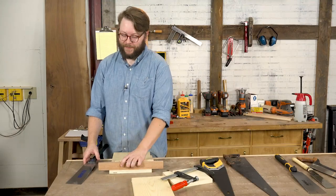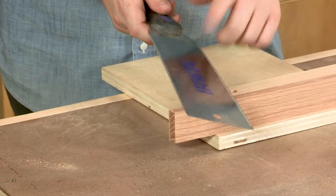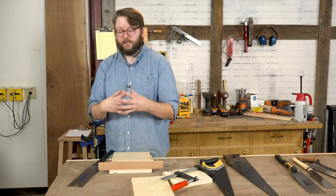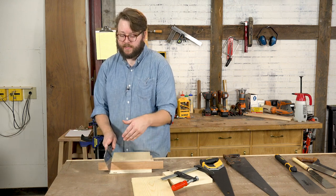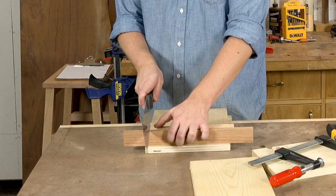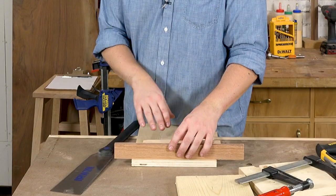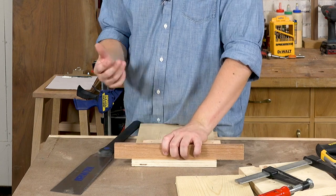We're going to be making a crosscut on our piece of wood — cutting across the grain — so we'll be using the smaller crosscut side of our pull saw. Whenever you're using any hand tools, make sure your hands are out of the direction of the cut. With a pull saw, there's a tendency for your thumb to potentially get into the path of travel since you're holding the piece in place. Just keep that in mind and make sure it doesn't happen. I'm using my body weight to keep the back of the hook against the bench and clamping the front in place with my hand.